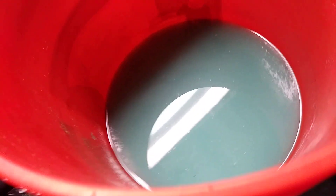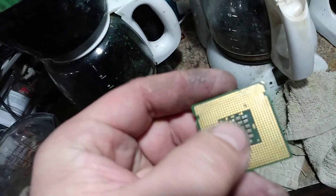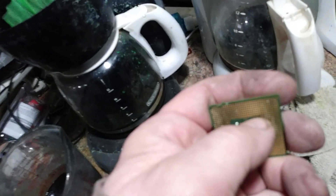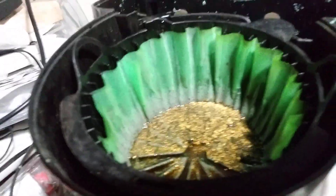Gold is like eight times heavier than water, so the gold kind of stays to the bottom. There's some floating around, but there's a lot of gold in there yet — you still have to deal with that even though it's just water. Because there's gold and there's MLCCs in there — that I should have taken off of those boards but I didn't because I'm lazy. Those middle pieces are what's making the acid so thick — I didn't scrape those off. Usually I do. So that's my problem — I didn't do it the right way because I was being lazy. But, yep, that's how you do that.